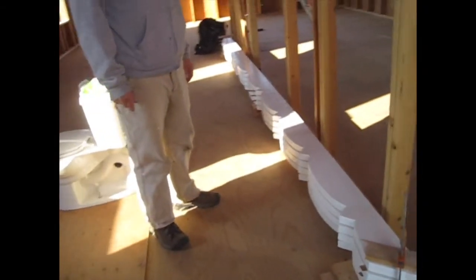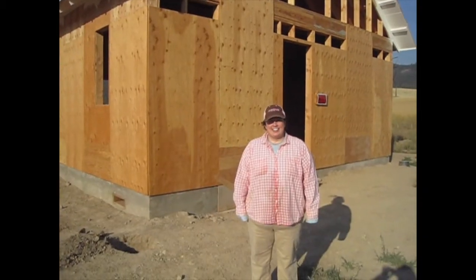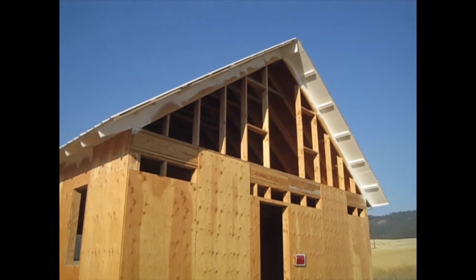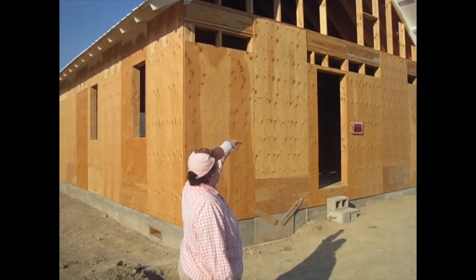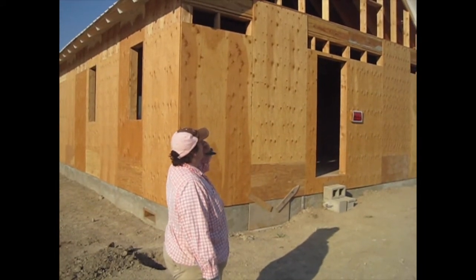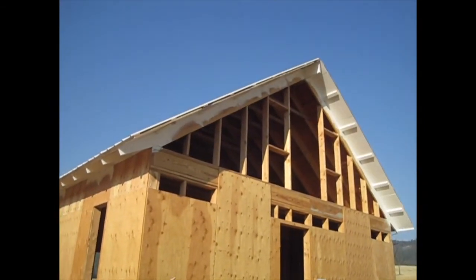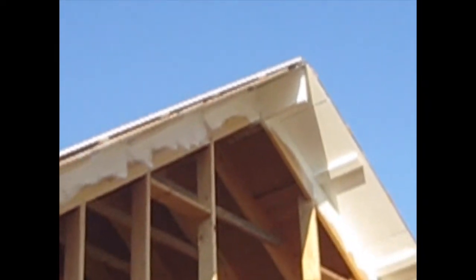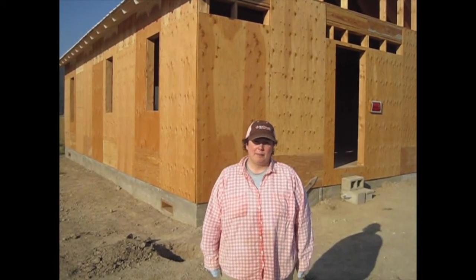The next thing we're going to do is work on our gable ends. We do have them framed out. Once we get our 12-foot tub in, we'll put in that center stud, then we can put on the sheathing and work on putting on the windows and shingles. We also have to put on the barge rafter, the ridge cap, and the rest of the trim for the roof. We also have a lightning rod system that we're going to be installing — that will probably be its own video.